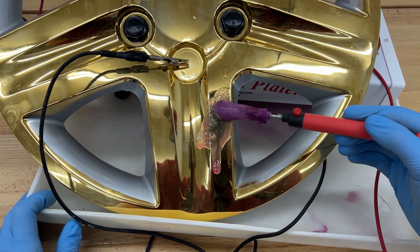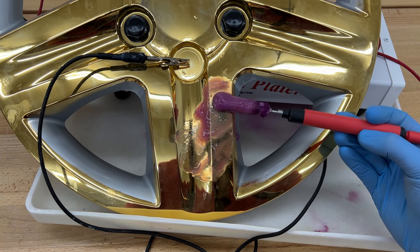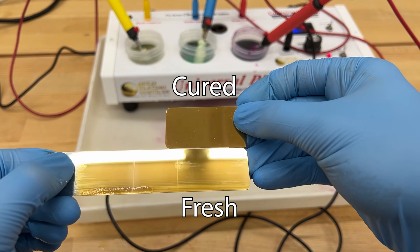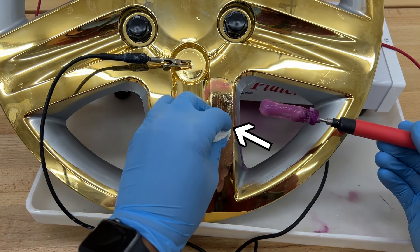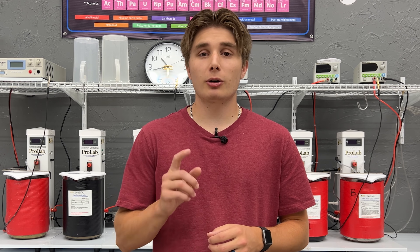With use, the gold gel solution becomes more runny and the purple color fades — this is a sign that the gold is depleting and you'll want to re-dip. It is normal for the color of your gold plate to slightly change as the plating cures. Fresh gold plating usually appears a little lighter than cured gold, and this curing process occurs within 24 hours of plating. When applying more gold on top of a gold flash, the color may initially darken and almost look like it's burning — but don't worry, the fresh gold plate will lighten as it cures. We hope this video has helped you understand more about our brush gold solution. Contact us by phone or email with additional questions, and thank you for watching.